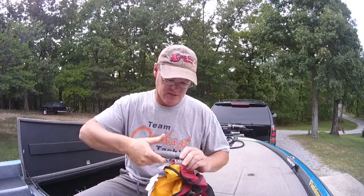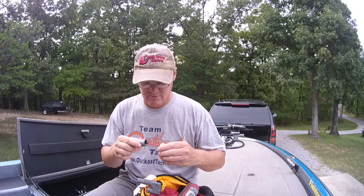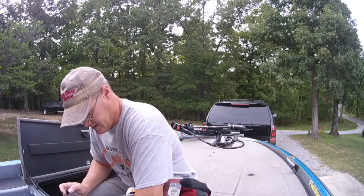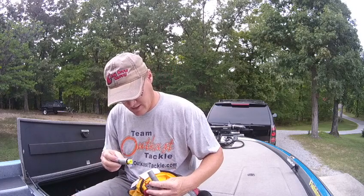To change your bobbin, generally you unscrew these here, and there's the bobbin we're talking about. On a really hot, humid summer like we've had, in the lower part of the country with as much humidity, all that is basically powdered aspirin inside there. And as it gets warm and moist out, it will eat away at these things. If you don't check it for a year or two, a $10 part could cost you, some of these refill things are anywhere from 30 to 50 bucks. So you can save yourself a lot of heartache by just changing these out when you're supposed to. And they will call for you to change them out generally once a year, whether it needs it or not.